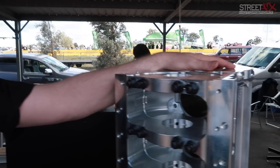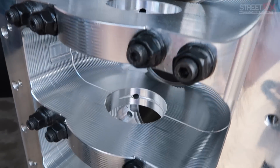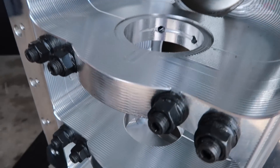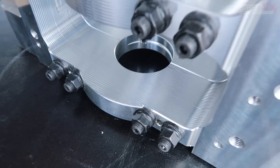That's one of the 2J's main advantages — the crank side of things. The 2J crankshaft is much beefier than the RB's. With the RB, you get torsional twist in the crankshaft as it rotates, and that takes energy away from the back wheels. The 2J bearing was a good fit — the diameter and width were very similar to the RB — and it comes in a set of seven journals, the same as needed, rather than going with a V8 bearing of similar size.